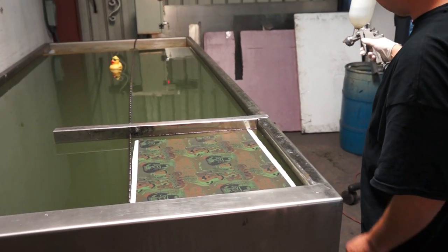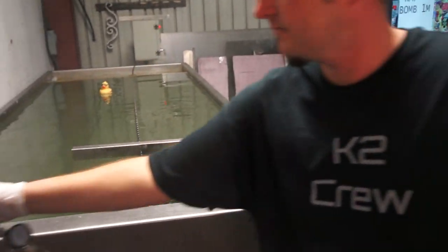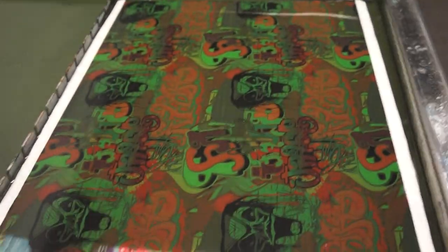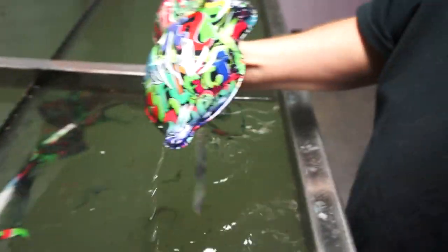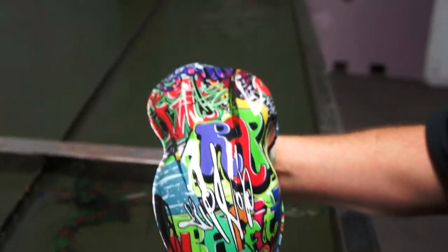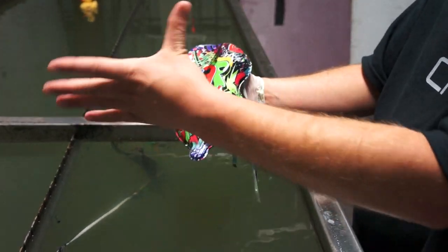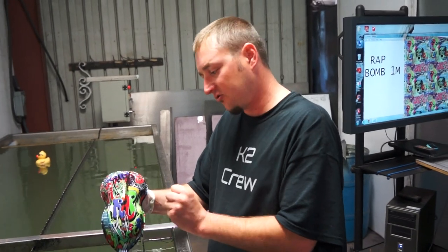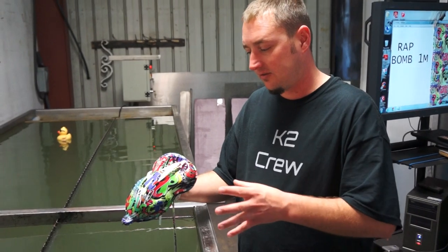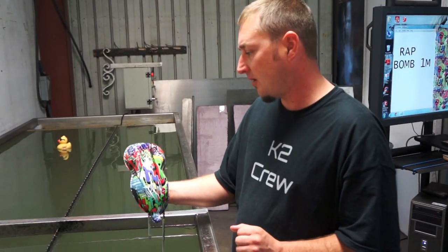A little drippy on the tip. That is a very, very thick film. I think I might try that with a 10-second longer soak time. You can see how this folds right here — that means it wasn't allowed to stretch when we pushed it in. The PVA film wasn't hydrated enough so it doesn't stretch like it's supposed to. We like to leave these things in the videos so you guys can learn from them, because this will happen — it happens to everybody. A little bit longer soak time on this print would probably fix this.